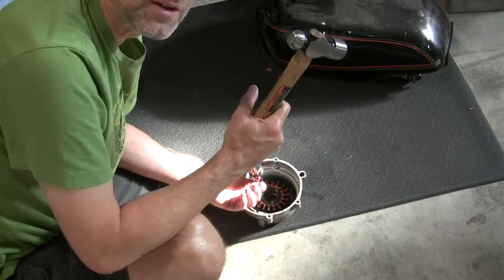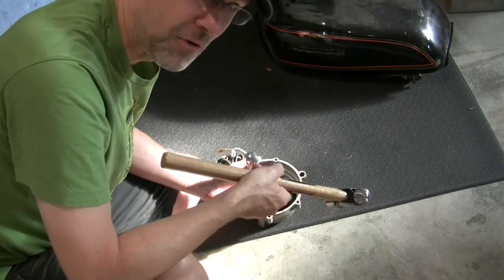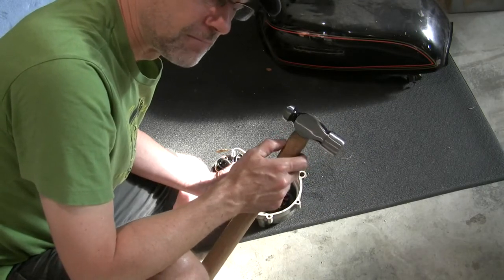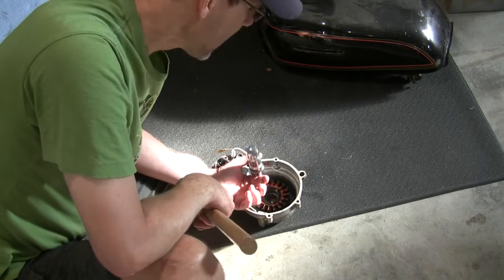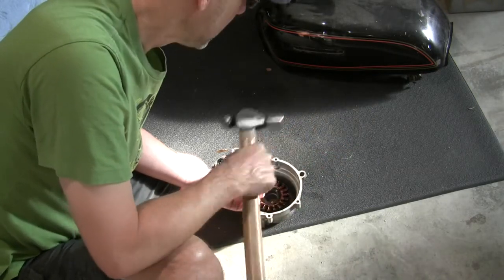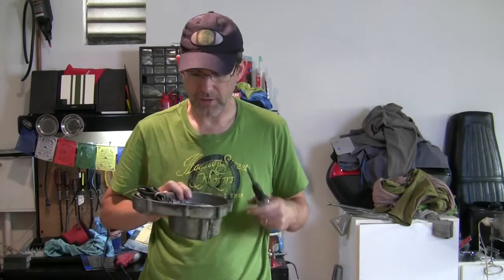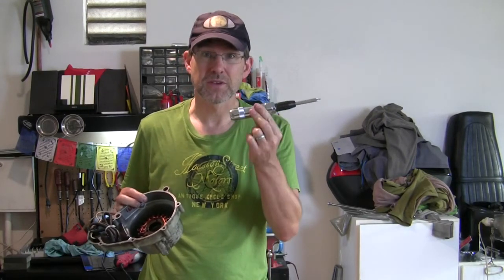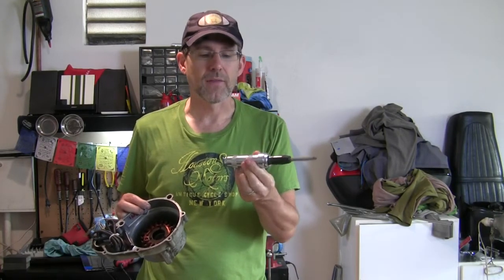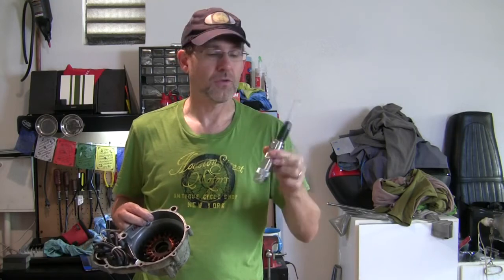The impact driver makes quick work of it. A shout out to Rodney from Allison Sales — quite a craftsman. He suggested that I stop using my regular claw hammer to hit my impact driver, because the steel in that hammer is so strong it could chip a piece off of this impact driver and send a bit of shrapnel flying, perhaps at my eye. He suggested a ball-peen hammer, which is a softer metal and won't damage this thing. Made the switch, Rodney — thank you. This particular part had five screws in it that were never coming out without an impact driver. I literally got this for $9.99, maybe $14.99 — it's not expensive, but you can't do this without one of these things. Put it in your toolbox.